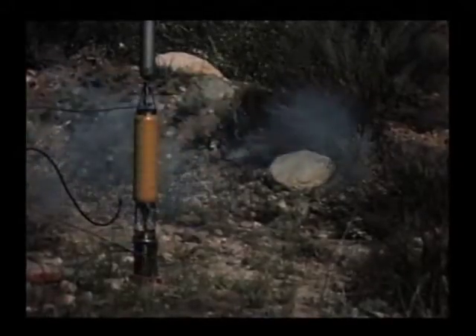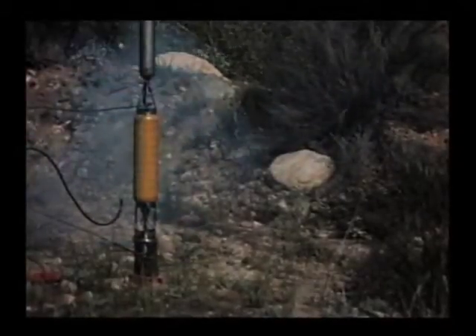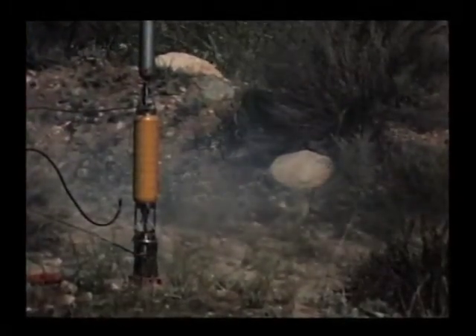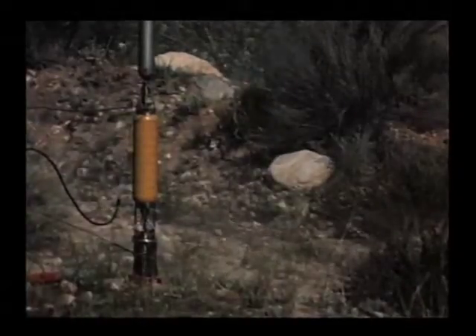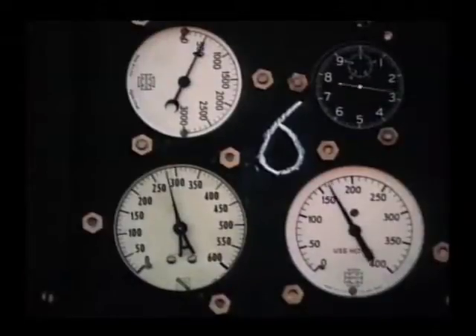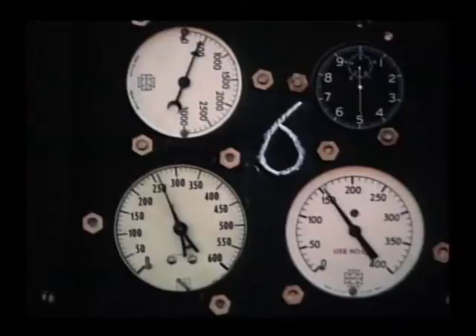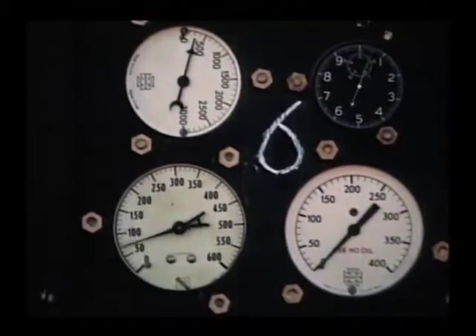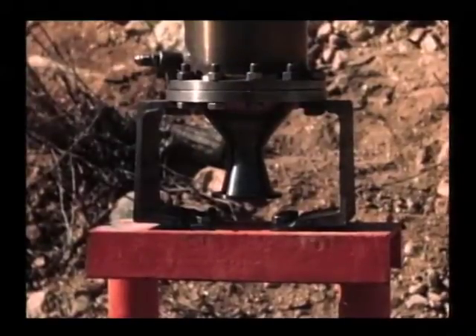Here are the solid propellant capsules burning and letting the nitrogen valve open. Now we have flow of peroxide through the thrust chamber. The pressure slowly decays as the nitrogen pressure drops off in the nitrogen tank. The nozzle turns blue from the heat of the decomposition.